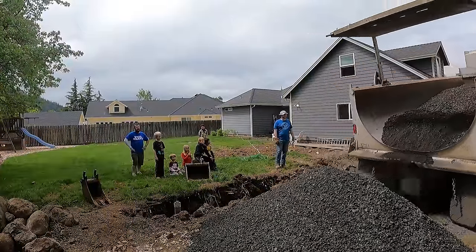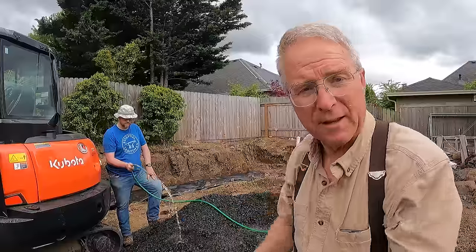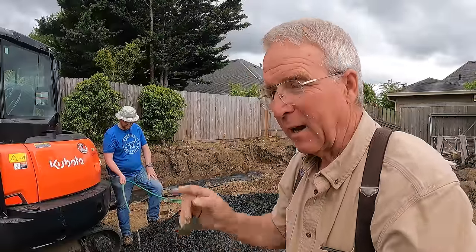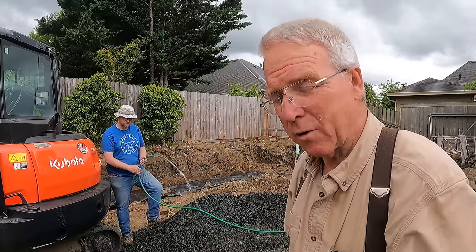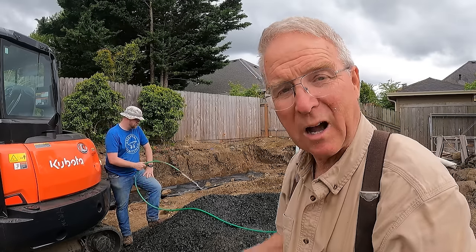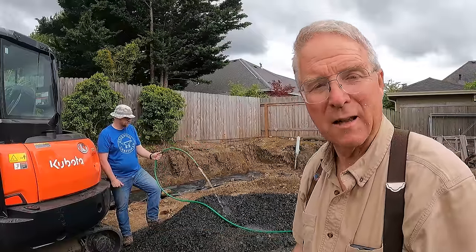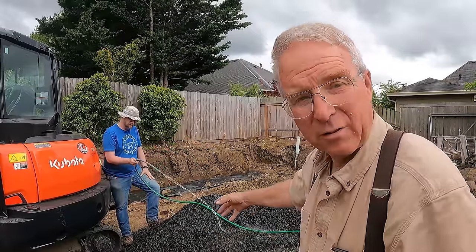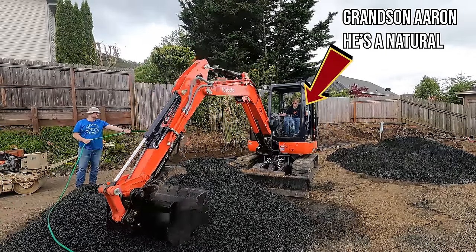What's going on here is trying to get some moisture into this crushed rock. One-inch minus means the rock has been crushed so everything falls through a one-inch screen. If there's not moisture in it, it won't compact — and this was crushed today and it didn't rain, so it's bone dry. In order to get compaction, the moisture has to be at what is known as optimum. Different rocks from different pits each have their own testing data called a proctor. We're just going to mix water in and mix it up until it will clump a little bit — not so wet that it's saturated, but just until it seems about right.